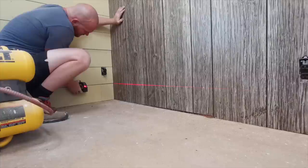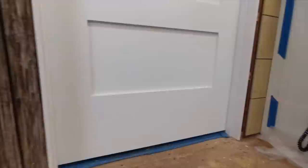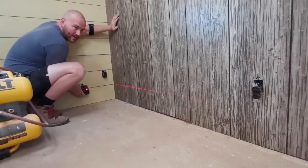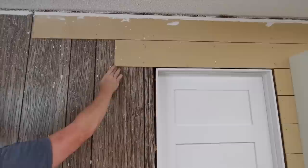Since I've done all the way around the house already, from here it's just touching. If you look to the right you'll see I was able to match it up — this is spanning the whole dining room and kitchen going around the whole house. I'm very blessed to have this line up because it's not always so nice. The problem if they don't line up — or if you don't compensate for it — is that above the door following the other wall it'll be way off, and then you're going to have to do some damage control.